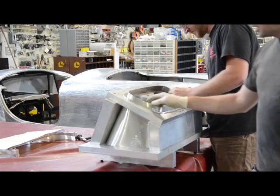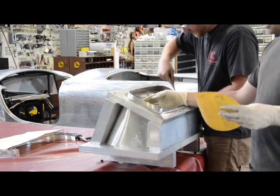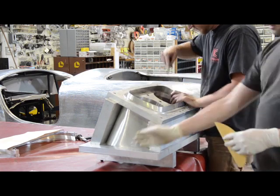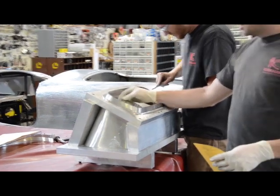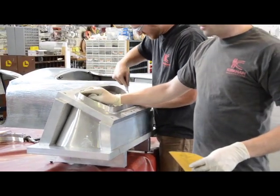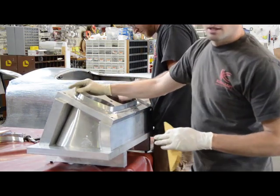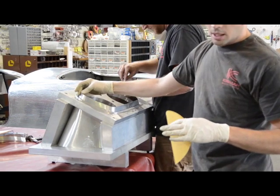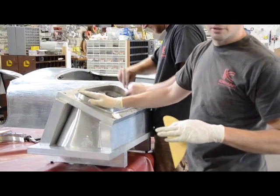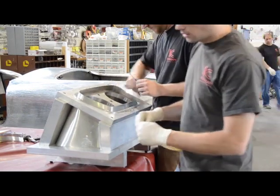So now we're on the other side. This is the nose — this is the inside towards the radiator, and this is the outside. We've got to sand these corners really nice because as we lay this over we're stretching it very far, and if there are any scratches or gouges in this edge, if it's not perfectly smooth, then it tears.